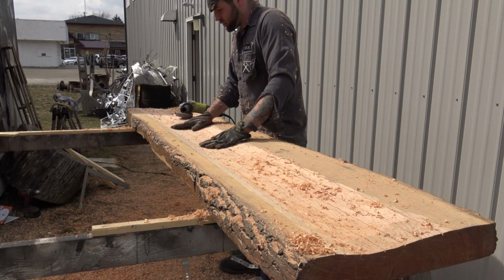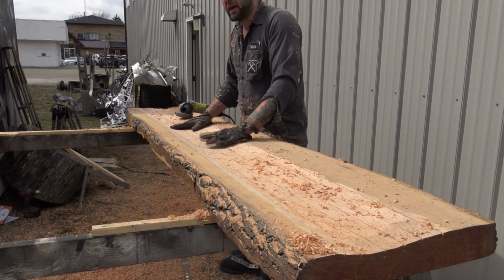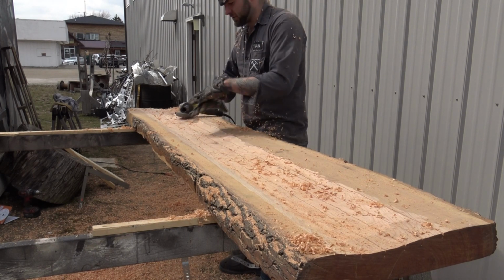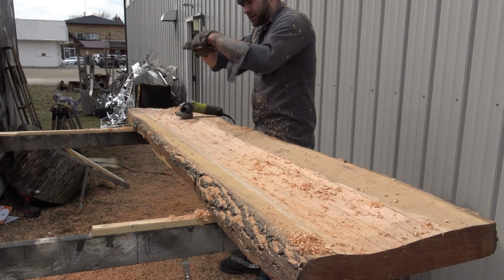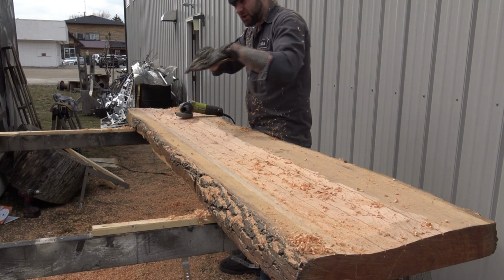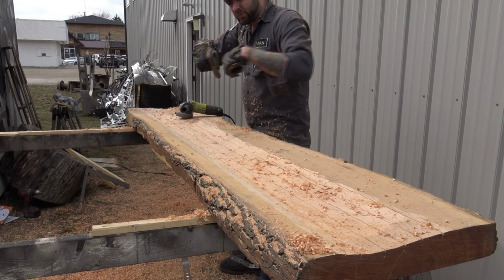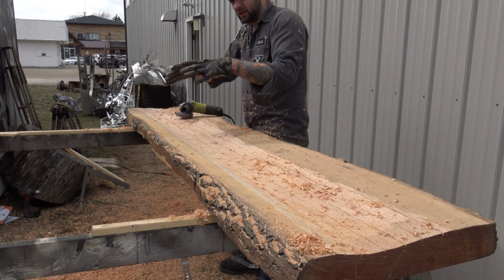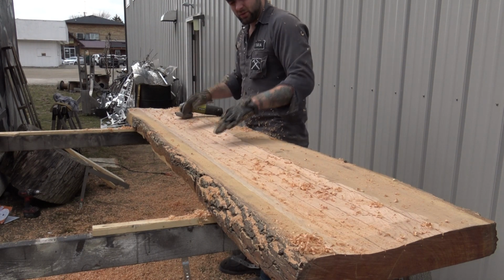Now, I've got a trick I learned from Annabelle Trades, watching a video where she was making a mandolin. What she had done was essentially the same thing, but because she had a compound curve that changed as it went, she used a drill press and went to different depths around the surface so that she could get a curve in both directions and make sure that she was still hitting her point.